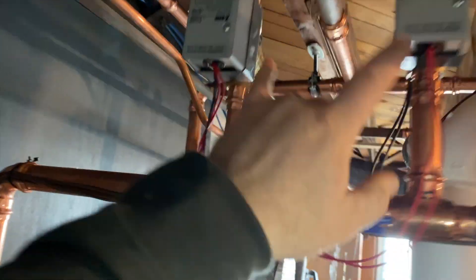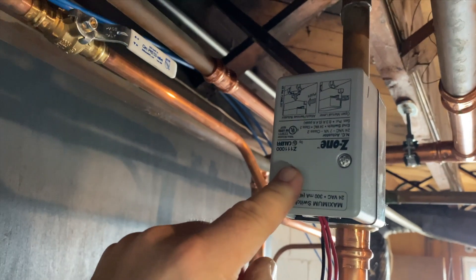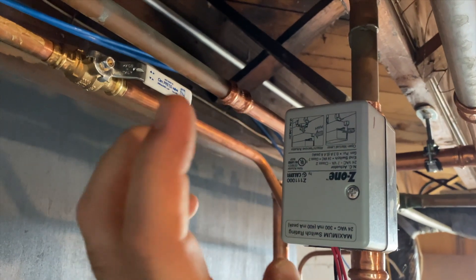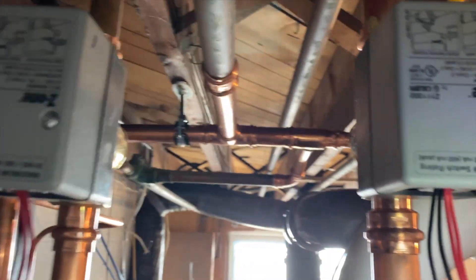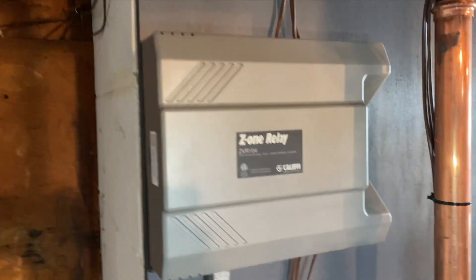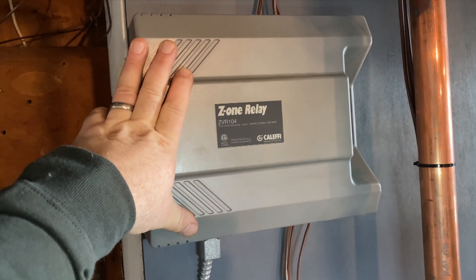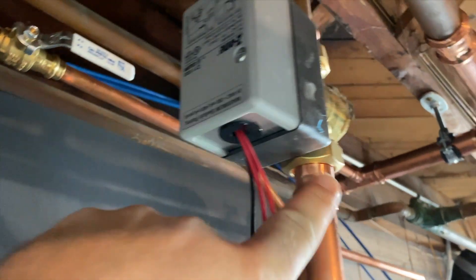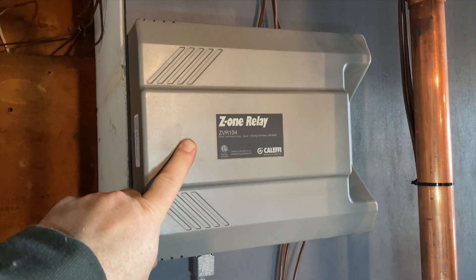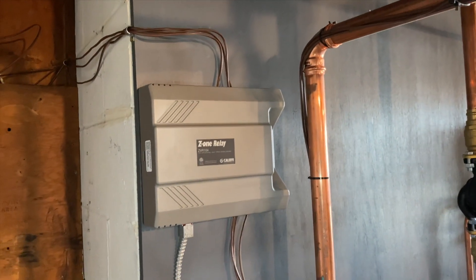The outdoor reset settings drive these zone valves — four-wire Caleffi zone valves, 24-volt low voltage at only 7 VA, so you can stack a ton of them on a transformer if needed. I use them with Caleffi's relay control, which has some nice built-in features. The reason I use this zone valve is its reliability and press union connections. When you couple the zone valve and the control together, you get a five-year warranty on the two units.